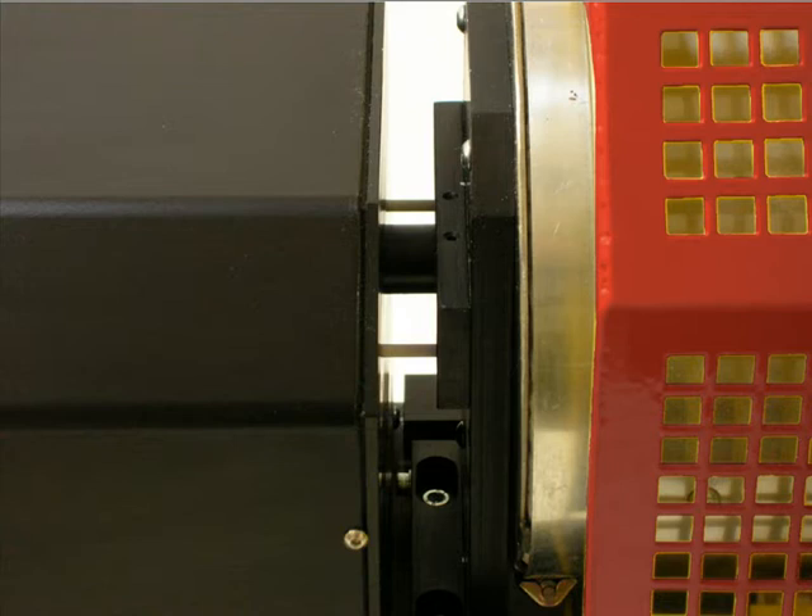The resolution of the optical system is pushed up to the limit of 0.5 micron per pixel, thanks to the use of a blue light with a short wavelength. The measuring field is up to 3mm upward and downward from the initial position of the sample. This is possible thanks to a computer controlled linear translation stage, which moves the optic to keep always the center of the sample inside of the field of view.